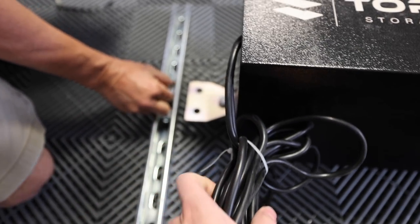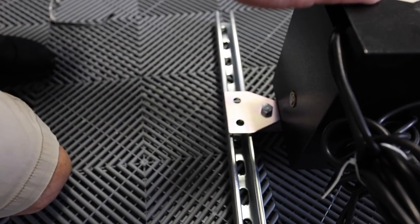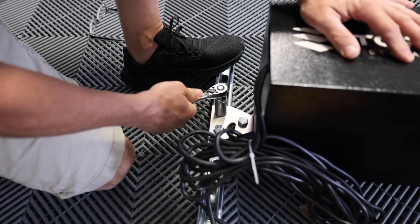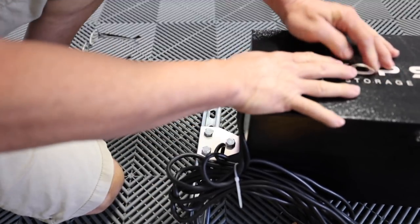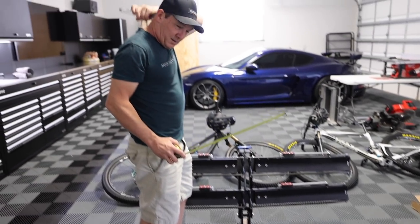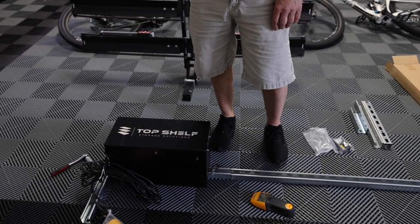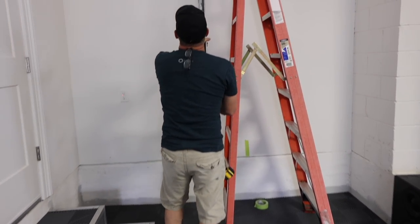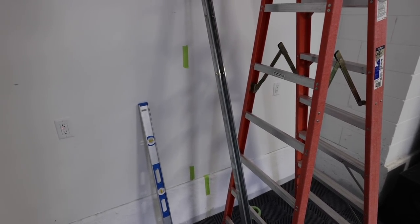So it's a little T-style spring nut - you put the spring nut in the strut and then this little T bracket makes it a T with two bolts. We need to mount the top of this strut 24 and a quarter inches or so minimum below the top of the ceiling. Those side holes are for the locking pin. I'm going to set the camera down, we're going to mount this thing and I'll show you what it looks like when it's done.